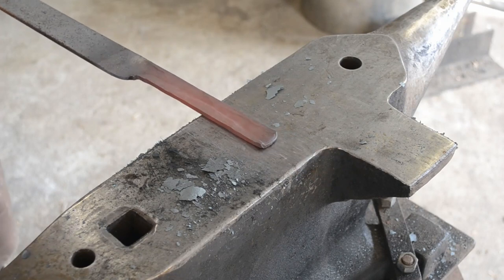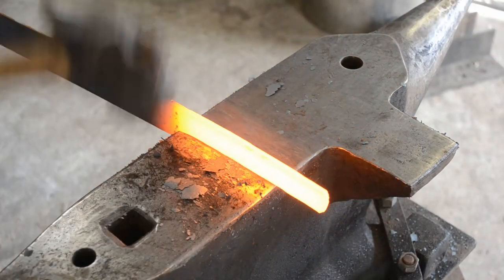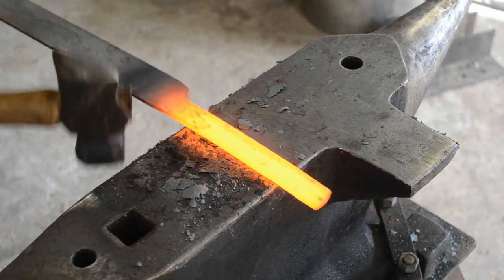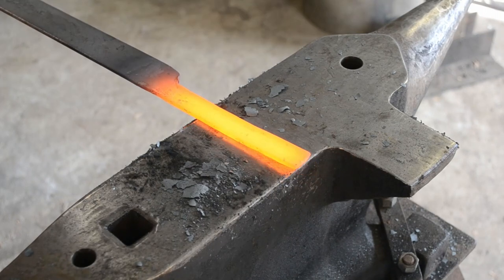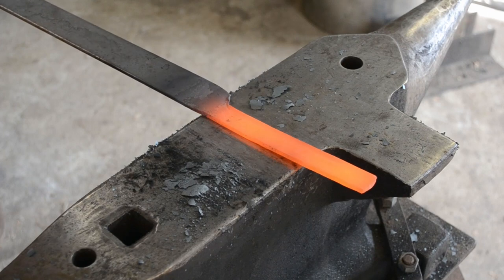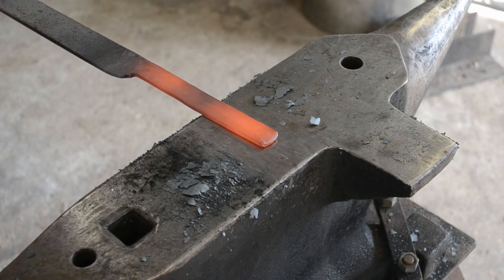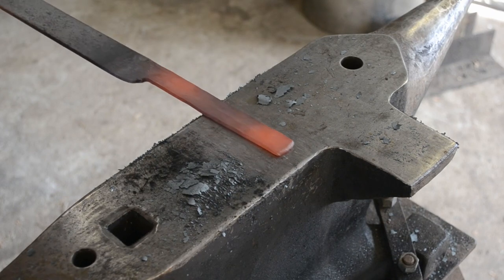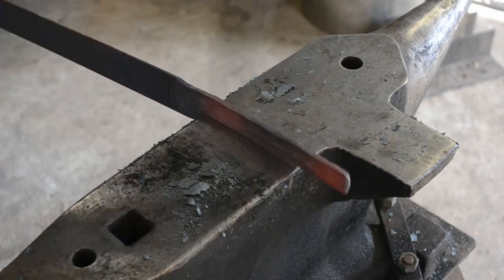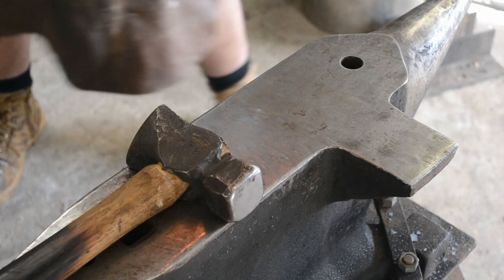In this case, forging on a very thin stock also teaches hammer control and control of lipping, cupping, that kind of thing that comes with forging quite thin stock. Normally I would advise against forging on such narrow stock because it will prevent you from getting your desired results, especially as a beginner smith, because it wants to fold on itself rather than forging. But learning how to manipulate thin stock like this will teach you a next level of hammer control, and getting nice flat and even bar stock just with a hammer and anvil is a skill unto itself.